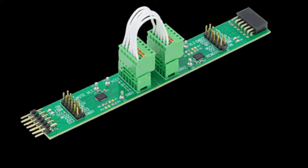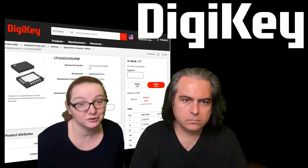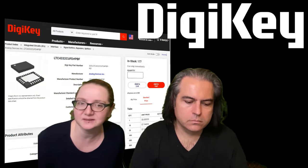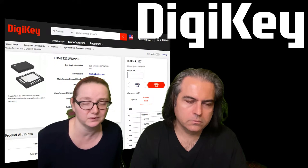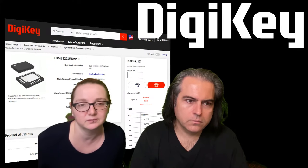You can get an eval board. I like this one because it's breakable - you can see in the middle they can break apart and wire up CAT6 cabling. You don't even need an ethernet connector, and in between I think it's a PMOD port, so you can connect it to your ready-to-go PMOD devices. The chip is in stock so you can get it. Don't forget you'll need two - one for the transmitter and one for the receiver. I'm going to make a breakout board for this chip. I like the LTC 4311 for I2C - it's been a great expander, letting you take I2C up to 100 feet easily with ethernet. But this one, going over differential link, is again 1200 meters or more.